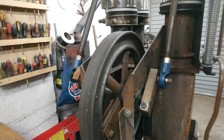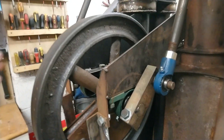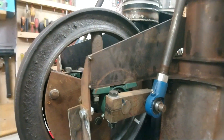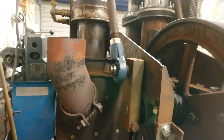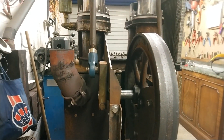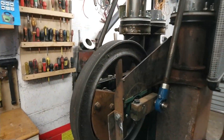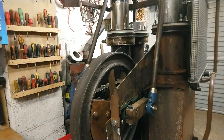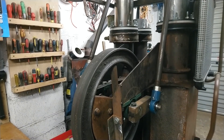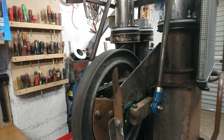With this test I'm also hoping to play around with the crank angles. Traditionally on a Stirling engine the phase difference between one crank and the other is about 90 degrees. As I understand it, this is generally what it ends up on most engines, but there is some flexibility with this amount. I want to experiment to see what effect that has on power output and at what RPM rates as well.